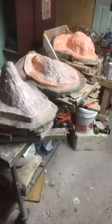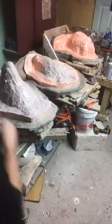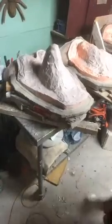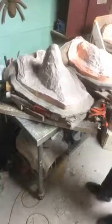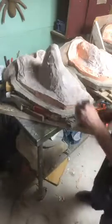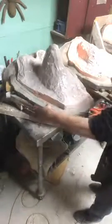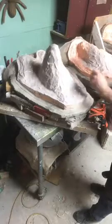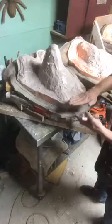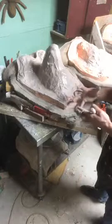I use a sculpting tool to cut mold keys. There we go. Alright, so you can see, in this first one, I put a groove in. It's roughly the size of an eraser, okay? So it's grooved in and kind of smooth, and by using the wet brush, I smooth down that groove, or you can use your finger and smooth that groove down. So when I have two pieces, it's going to lock it and hold it perfectly in place. So the silicone should in turn line up in place, and when it gets pressure, it's going to keep it locked tight.